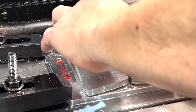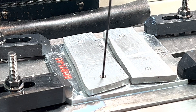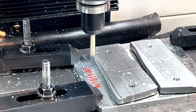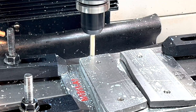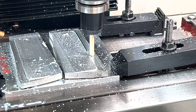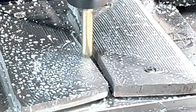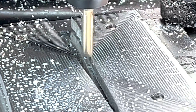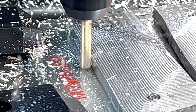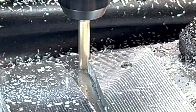If you have hopes and dreams of one day making your own grips, my one important safety tip is to use small pan head screws. You do not want the top of that screw to protrude outside of your part, because if the mill cutter catches it, it's not going to be pretty. The facing operation is not necessary in aluminum; however, in wood and composites, the cutter tends to rip material out of the grip during the adaptive toolpath. I'll show you exactly what I'm talking about here in just a few moments.